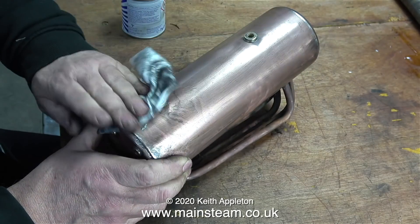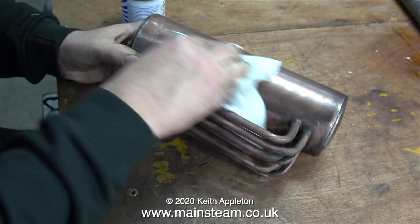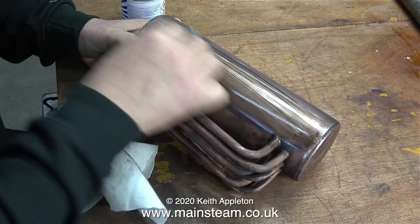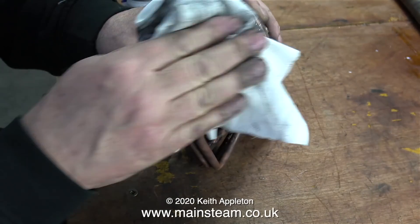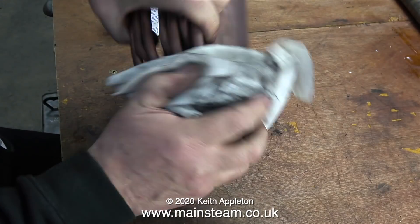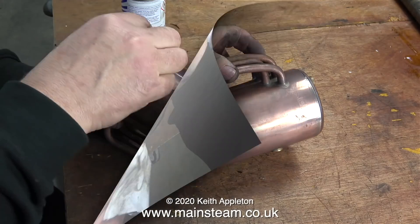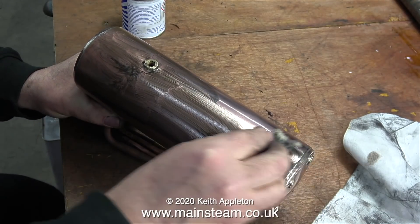Stewart Models are currently remanufacturing 504 boilers. You can clearly see in this clip that underneath the boilers are a selection of tubes, and the three sizes of 500 boilers have different numbers of tubes. In the 504 boiler the centre tube is a superheater, known as a steam dryer. When steam leaves a boiler it's called wet steam — if you reheat it, the whole thing becomes much more efficient; the higher the temperature, the higher the pressure. On the 504 boiler the superheater is a simple tube that goes from the top of the boiler internally out through the fire, back into the boiler, and up to the bush where the main steam outlet tap is fitted.